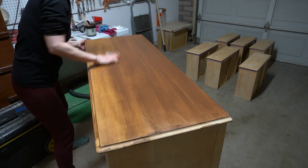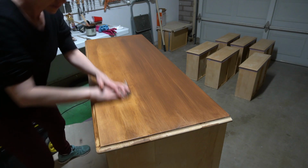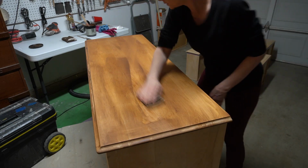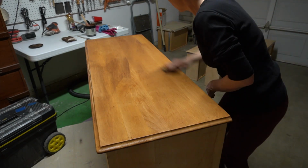I had no choice but to wet the applicator pad. Once I wiped things back, there was almost no stain left, but the color was definitely right. And I knew then that if I wanted to get a smooth and even application, I'd have to use a combo of the brush and a wet applicator pad, and I was gonna have to do multiple coats.